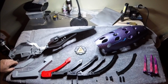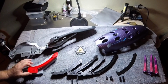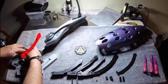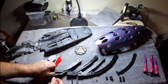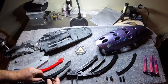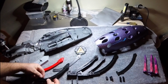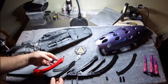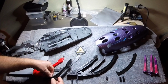So back to the drawing board, came up with this guy that is much smaller. It has a much better profile, but it was still too large to fit the needles in with it. So I had to go back for a third design, and that's this guy here. I got rid of the traditional rocker switch for the limit switch, and went with these tiny 2-prong push button switches that'll mount up here in the front at the end of the needle travel and catch the needle as it slides down. Now the needles themselves will travel in these shuttles that fit in the slot here.